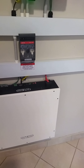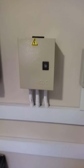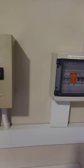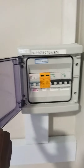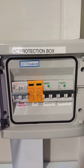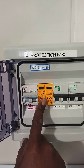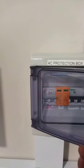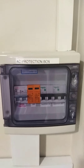The owner specifically insisted he wanted a manual changeover switch, so we've put a manual changeover switch there. There's our AC protection box. The DB is in another room, so we're coming in at 40 amps through the surge arrestor to the inverter input, and then to the inverter output at the AC protection box.